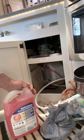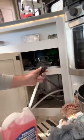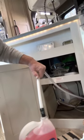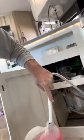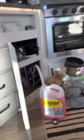All I do is pop this hole in it — don't let that silver piece fall in; if it gets in your pump it could mess it up. Take the cap off and stick the hose right down in there. The reason I'm worried about spilling is that this stuff can be very sticky — when you're done flushing your lines you really want to wipe all the antifreeze out of your sink and toilet, because if it dries up it's super gummy. Now I've got everything closed, antifreeze in there, everything bypassed. I'm going to turn on my water pump and you'll see the pink level dropping in the tank.